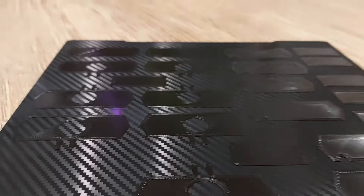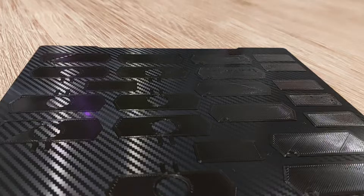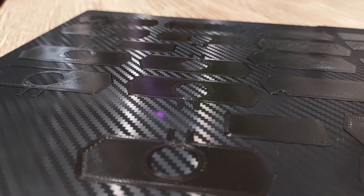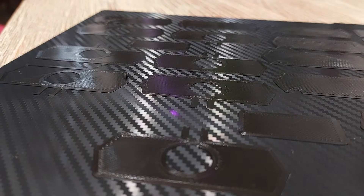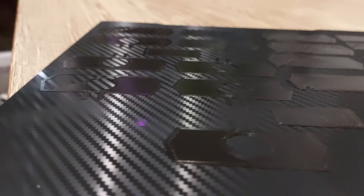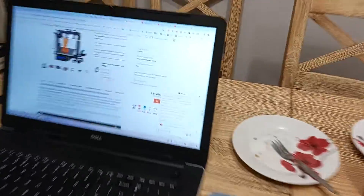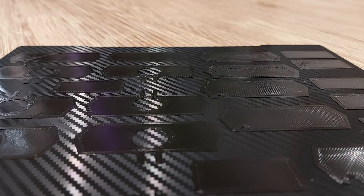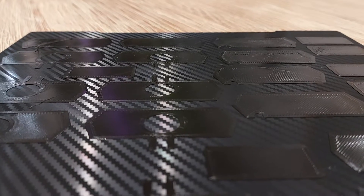What I found is they only limit you to 15 mesh points. As you can see I'm using a custom plate and it's not perfect. I need to increase my bed mesh points — say to 30 — just to make sure everything is fine. But I can't do this. I'm on support right now and they're saying you cannot increase the number of points. Why do they limit people from doing this?